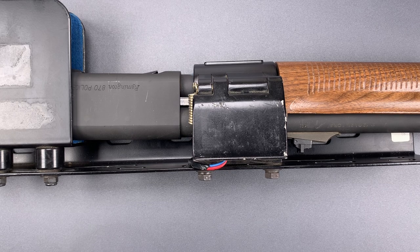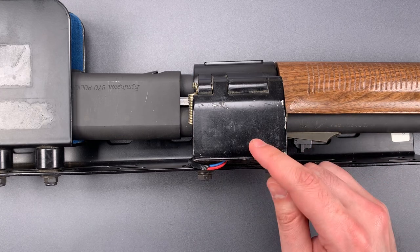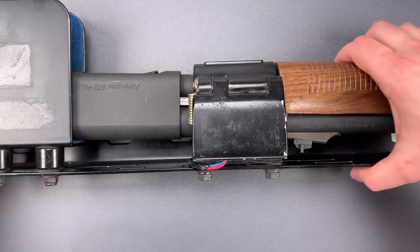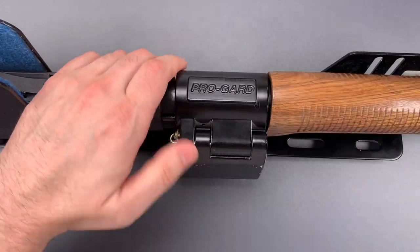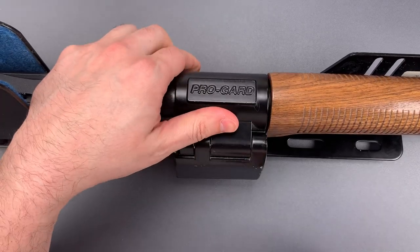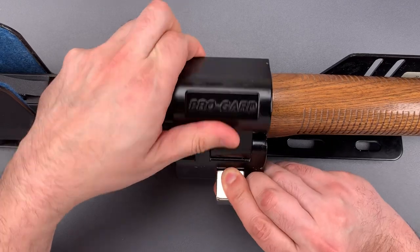But let's put all of that aside and assume it has an extraordinarily pick-resistant core — there's still a problem. The locking bolt can be retracted simply by placing a powerful magnet on the side. Let's give that a try. As demonstrated, the lock cycles between locked and unlocked repeatedly just with the magnet.